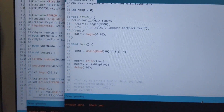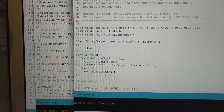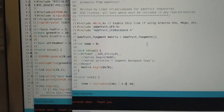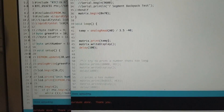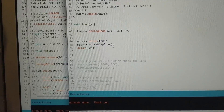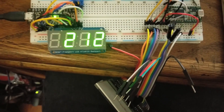This is the entire code right here. If we come up here, it uses the Wire library, the Adafruit GFX, and the LED backpack library. We tell it up here it's a 7-segment, then we tell it to begin. This is all it takes to write - you tell it what you want to print, and then you tell it to actually write. This sends the final command to write everything, and it just has a 100 millisecond delay so that it's not sending stuff constantly.